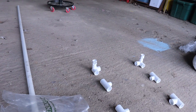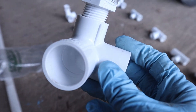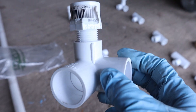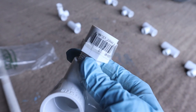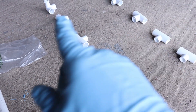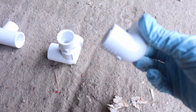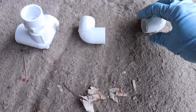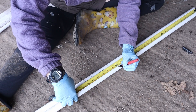So here's my idea — very simple. They didn't have any T's or PVC corners that went from three-quarter inch to half inch with the slip. So I just got a little creative: I got the three-quarter-inch T elbow on the bottom with this joint, and it screws into a half-inch slip adapter. Those are going to be the corners. Spaced out every two feet are going to be these T's, and I got two half-inch elbows to make a simple door. I'm going to space out the three-quarter-inch PVC on the bottom every two feet because the hardware cloth I'm putting on top is two feet long, so it'll go nicely over each edge.